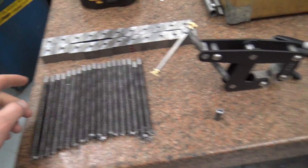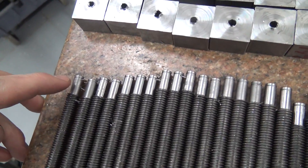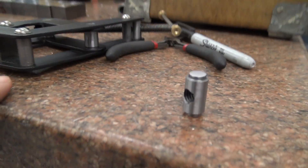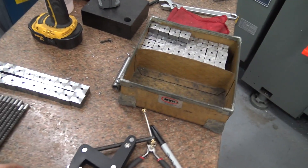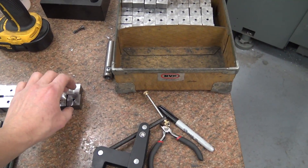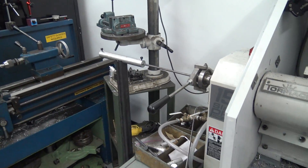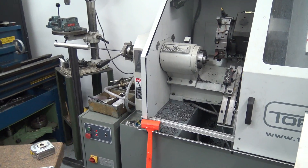As a little teaser - we made some pieces of the all-thread. We are switching from a nut to an e-clip on the end. The Tormach lathe has been a champ at making these parts. Right now in it we've got these little spacers - you can see the first one that came off, which are what space the clamp apart. That first one obviously has a burr we don't want. The blocks are interesting; we're doing those in the lathe in one op, which we can do a video on. We made this test piece to run longer pieces in our Tormach lathe, and we're super excited to get the automatic collet closer so we can automate that lathe as well.